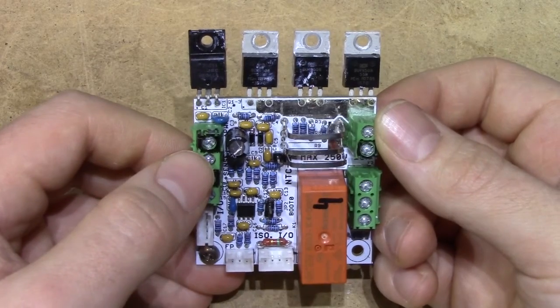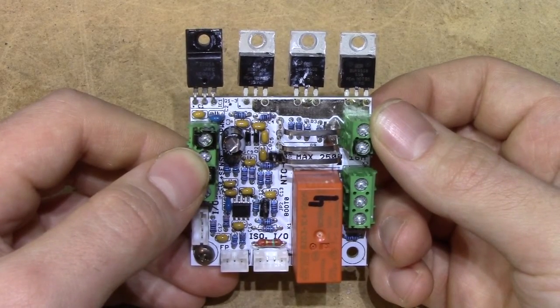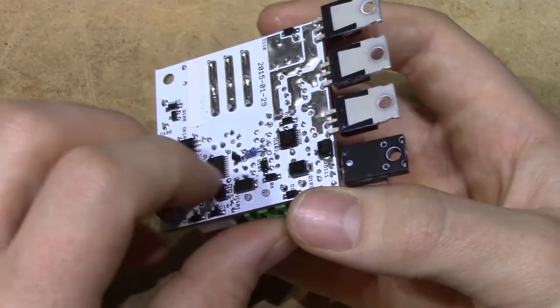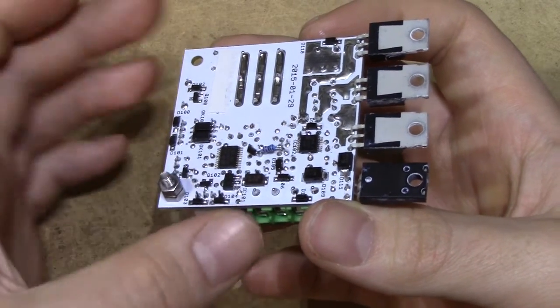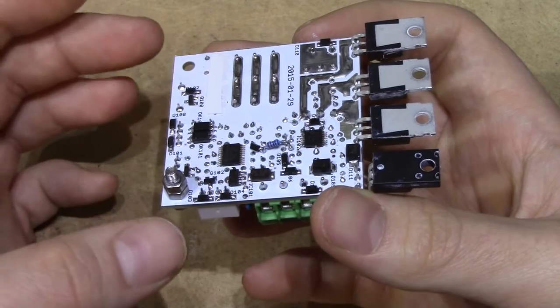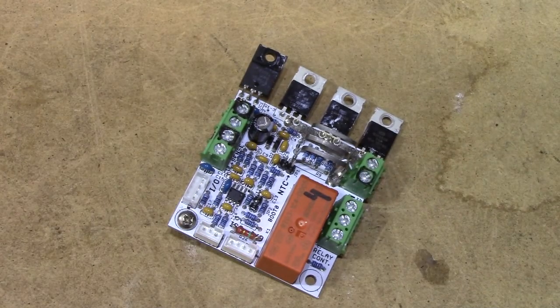As for the accuracy of this unit, we didn't really specify anything when designing it. It's running off a reasonable low-drift 3.3V linear regulator as a reference, which should be good enough for this test. We don't need more than a couple of percent of accuracy on everything, since this is basically intended to test lead acid batteries, and those are hardly known for their very tight tolerances. So as long as we're within about 5% or so, it's going to be good enough. If we ever make a revision 2 of this board, it may or may not have a more accurate reference, but that's why we have this revision 1 board — in order to do some characterisation and test feasibility.